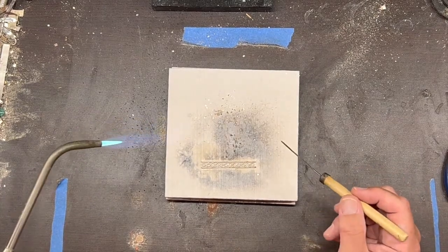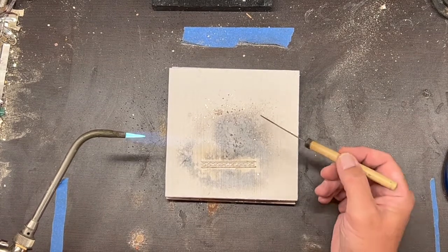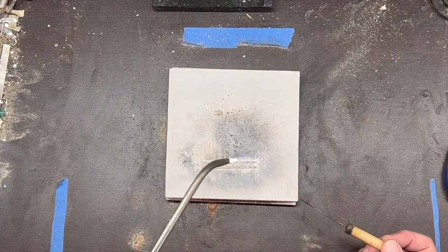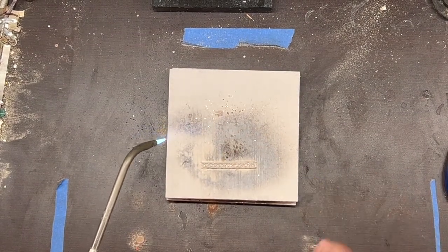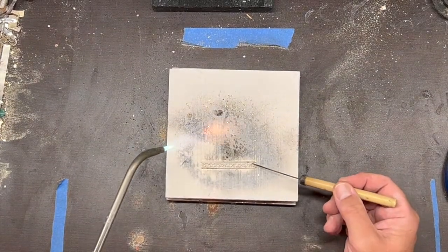So honestly, the trick to doing this is, ideally I'm going to melt a little piece of this onto the end of the pick. I'm going to heat this piece up to 1450 degrees, and then while it's 1450 degrees, I'm going to touch that piece of solder to the spot where I want it to go. If this is hot enough, it'll melt it right off the tip of this,